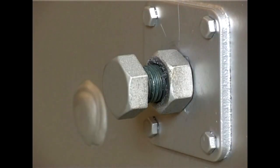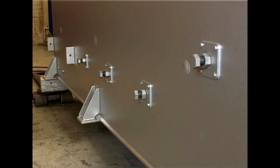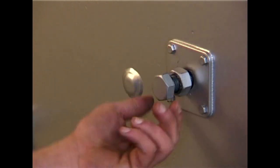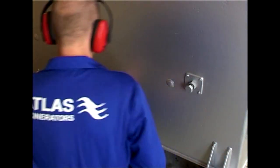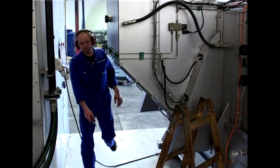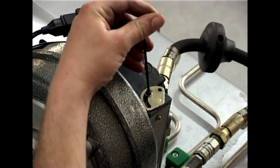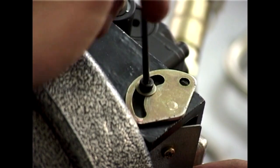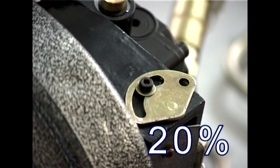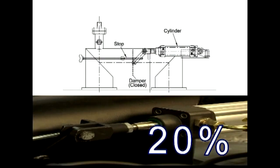The next step is adjusting the air nozzles. The air nozzles lead air from the cooling air jacket into the combustion chambers. Adjust all the air nozzles by turning them clockwise until they are completely closed. This will give the shortest heating-up period of the incinerator and reduce the consumption of diesel oil. Finally, you need to adjust the dampers, which will help to obtain a proper flame on the diesel oil burners. Adjust the dampers on the diesel oil burners to approximately 20% open position. Adjust the damper on the sludge burner to approximately 20% open position.